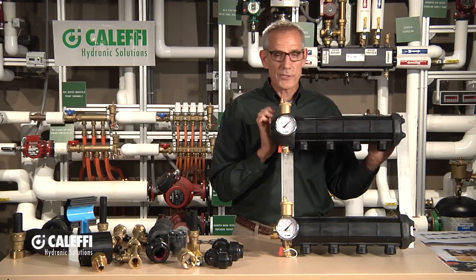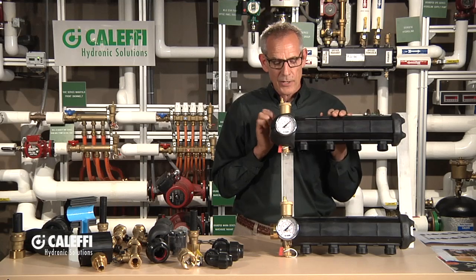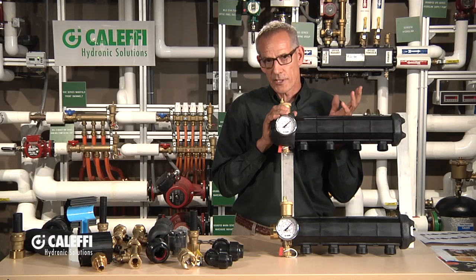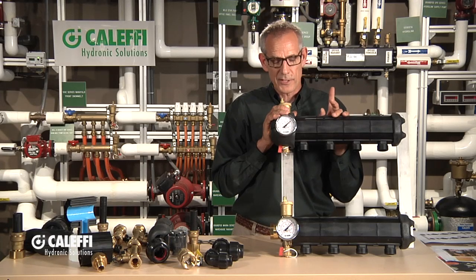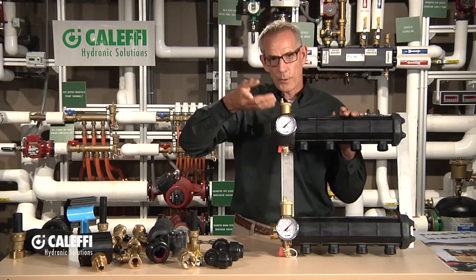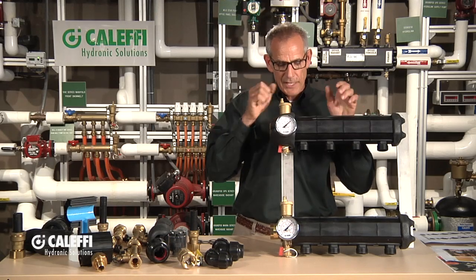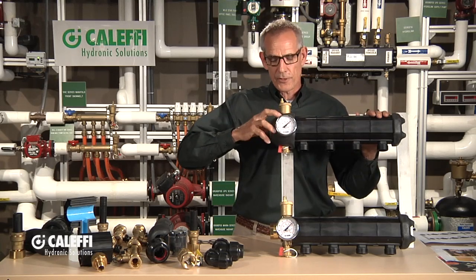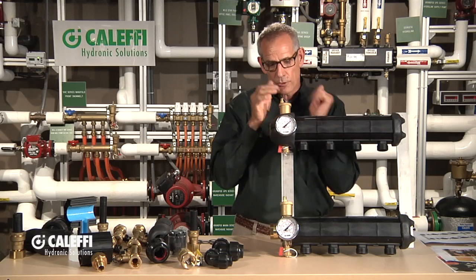You can mount this on the wall — we give you brackets with keyhole slots already in it, so you just put some fasteners on your wall and latch it on. Sometimes you'll want to mount it out in the yard, maybe in a yard box. There are companies that make concrete or plastic vaults for that. I actually put one in my own home using a lawn sprinkler box as my vault on the edge of the pond — it's a loop field that goes into the pond. If the manifold is laying down, the vents need to be turned up, so let us know at the factory and we'll put the vents in the right orientation. We'd prefer to do the assembly at the factory to make sure everything is lined up and torqued properly.